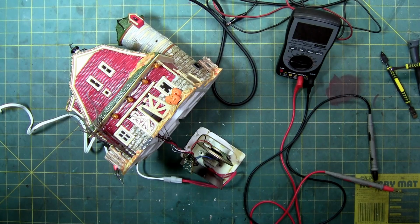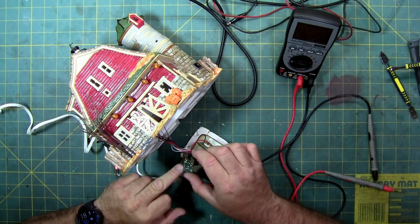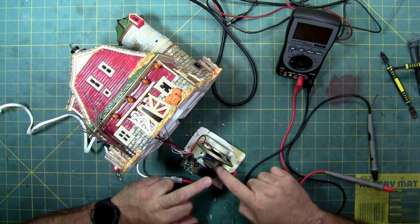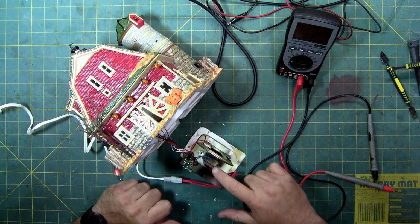In some cases that amplifier chip fails, but same with Lemax. The blob chips crack. They can crack from an overpower spike, or plugging in the wrong power supply. In this case, I'm going to go with this thing because it's putting out too much juice. It's outside of its 10% tolerance.